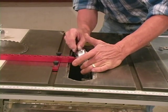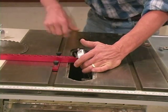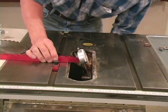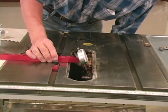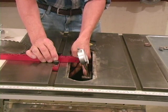Now you notice I'm holding that indicator up against the arbor flange as I lock this, because what's going to happen is as I elevate my arbor and we start making contact, I'm going to use my blade elevation to bring me up to zero. By doing this it actually brings the indicator away from the flange, but you do want to make sure that you're not sitting on the threads.